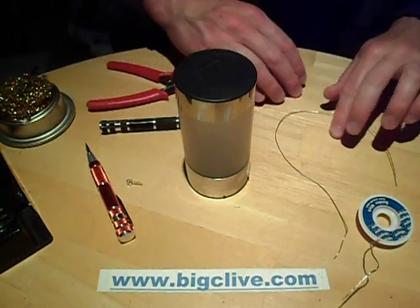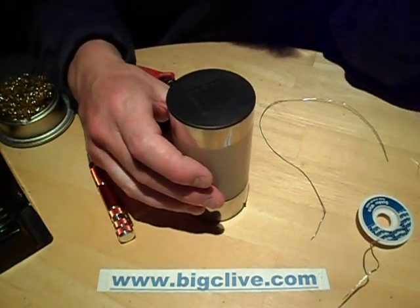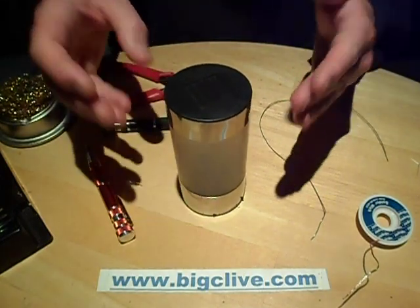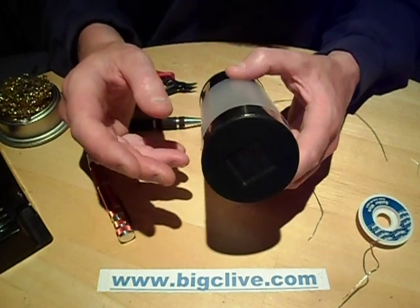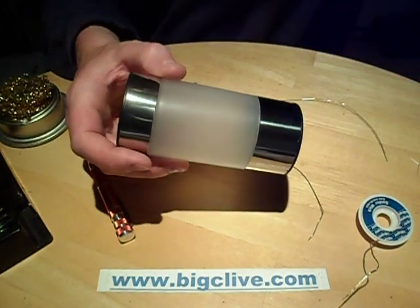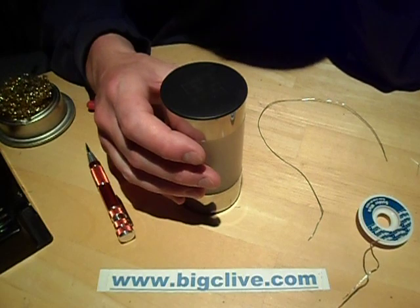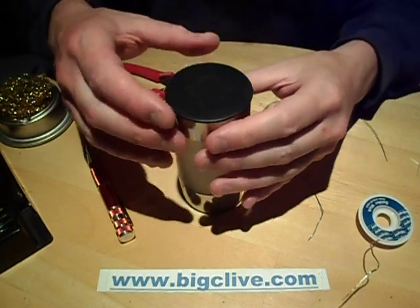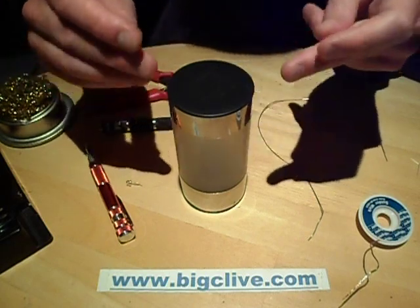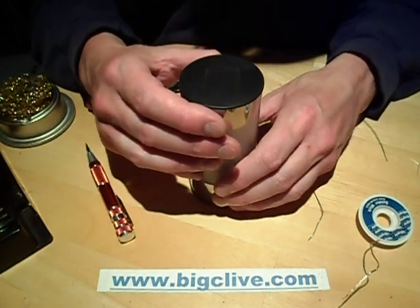And you can use any colour of LED you like, noting that if you use the lower voltage LEDs like red or yellow - yellow's an absolutely terrible colour, it's usually very dim, but red's quite nice. Sometimes the lower voltage of the LED affects this delicately balanced circuitry and it will come on too soon and use a bit more current and run out earlier. In those instances you can actually put two LEDs in series, joining the positive and negative of each together to create a series circuit, then poke the other two leads through - that also lets you mix colours. I've got a note about that on my website at bigclive.com.